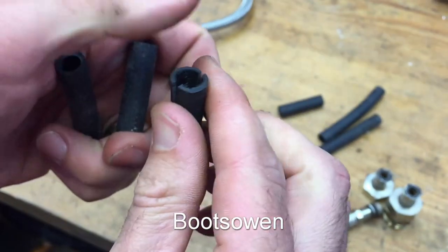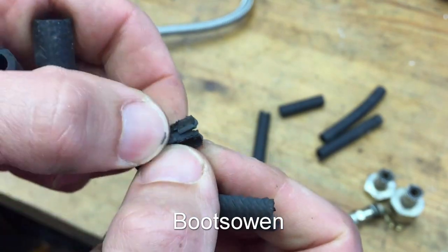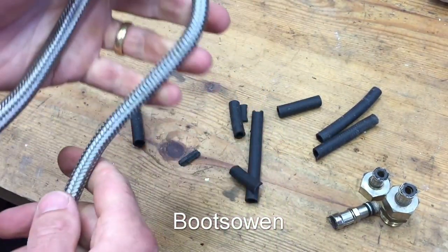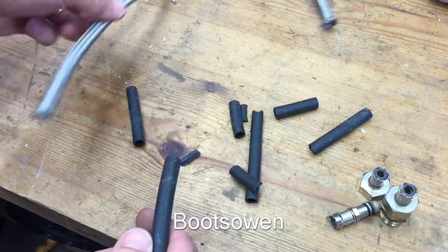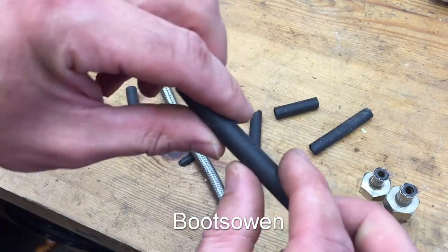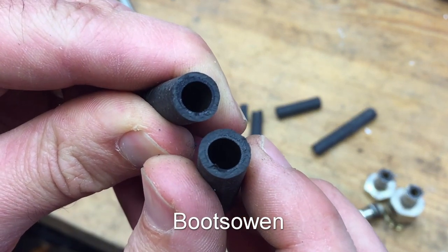And if you've got that — and this was, bizarrely, on a vanity unit — it means water pressure. If you've got that and you were to have kids in the house pulling on it or something, it's just going to leak. The braiding doesn't keep water in. That's just completely porous. It's just braided stainless steel wire. Crazy.